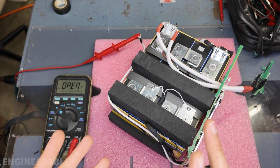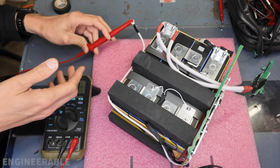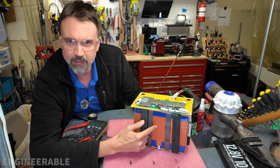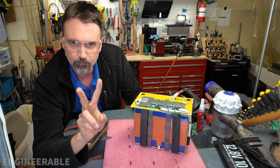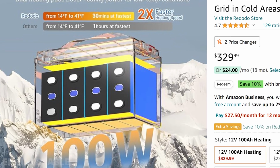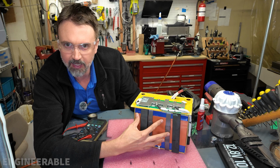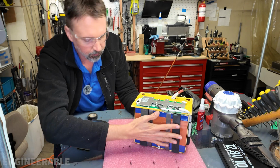I was confused about it being 2 50-watt pads versus a 100-watt single pad because it said dual layer pad, so I thought that meant 2 pads. So having tested this heater pad, it measures 100 watts. But the way the marketing material is written on the Amazon website says it's equipped with dual layer heating pads totaling 100 watts. That gave me the impression that it's 2 pads because pads was plural and they total 100 watts, 50 watts each. Since there are other more expensive batteries that have a 50-watt heater pad on each side, I assumed that's what that meant. But I think what they're saying is it's actually a dual layer single pad that is 100 watts total power, which is what I measured. This pad is very strongly adhered, so probably double sticky 3M adhesive to the bottoms of the cell.